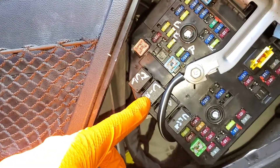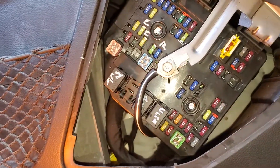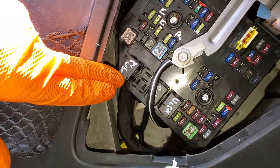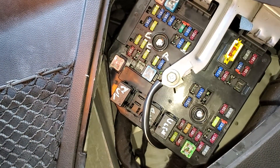There's also a relay involved — this one. You can tap on that relay, you can also remove it and swap in a different relay as a troubleshooting step. For example, you could swap the relay next to it and see if your outlet starts working.